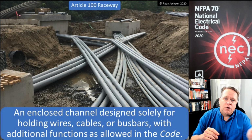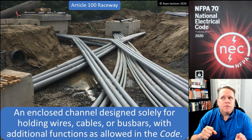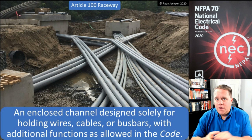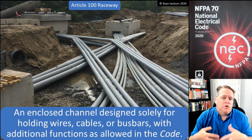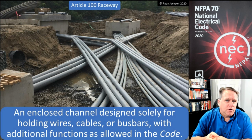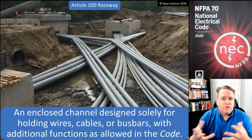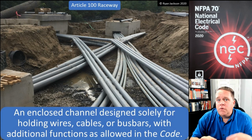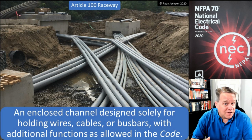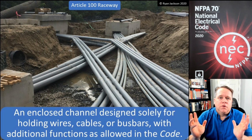After Article 340, we go into Article 342, and continuing up to, I think, Article 380 is the last I can think of that covers raceways. And the most obvious ones are those like in the picture here, PVC conduit, or you have EMT, you have rigid metal conduit, IMC, you've got HDPE, which is used underground, you've got RTRC, reinforced thermosetting resin conduit, which is a fiberglass conduit that you might have installed. These things are all raceways, and what they have in common is when you buy them, they don't have wires